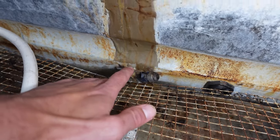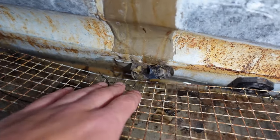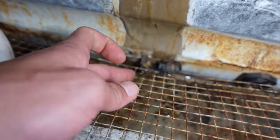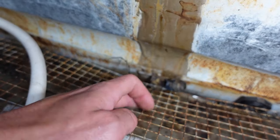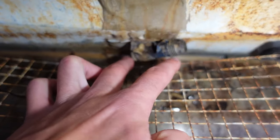The next thing I have to show you is what is connected to our hose line — a little T-hose pipe fitting that I have clamped on the other side using one of those little fasteners. Out into our trough, I have the two prongs going in multiple different directions to cover the whole trough full of steam. That's another reason why I have the standoffs: without them, the steam would just get absorbed by one block and there wouldn't be a very equal distribution of heat within the trough.